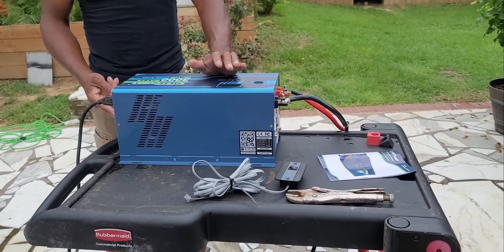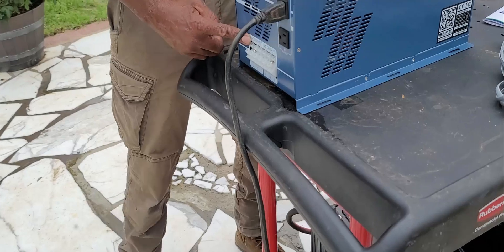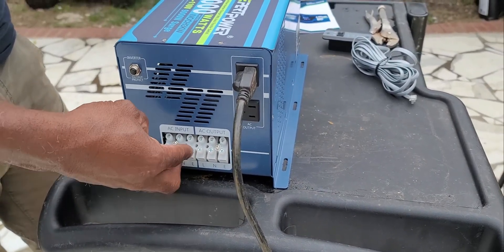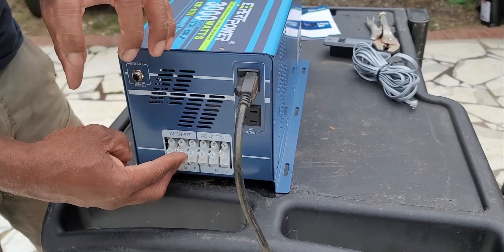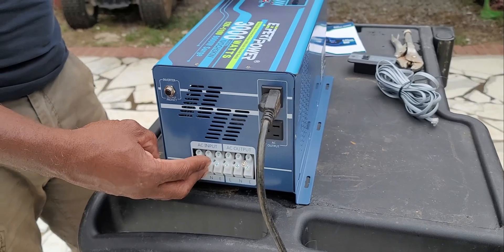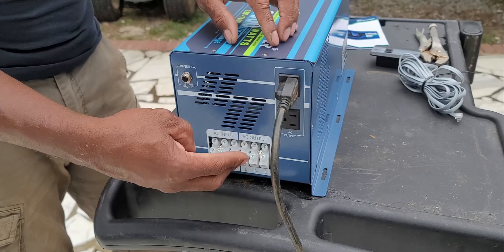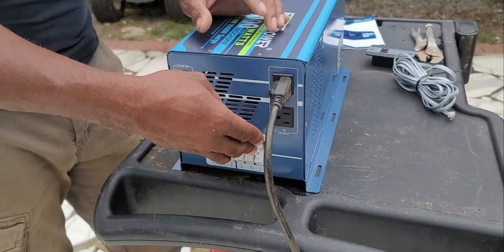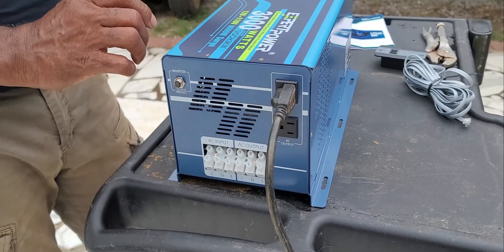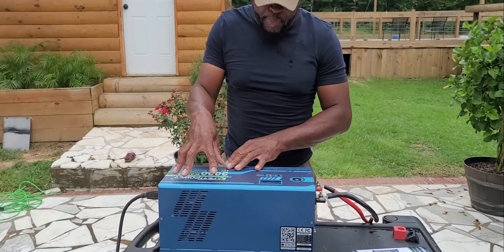Now let's go over this just a little bit. I like this because you can actually run this into your shore power, hook it up to your shore power. And right on this side over here, you have six outlets. The AC input side is where you're going to run your AC power into this inverter charger. What happens is that power goes in here and it's rerouted, and so if you have a battery bank like this has, it'll actually charge your batteries and keep them charged up, and it brings your power back over to your AC output, which gives your shore power to everything in there. Now, we set this on AC priority.